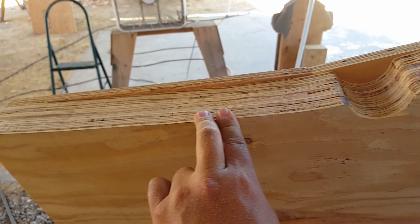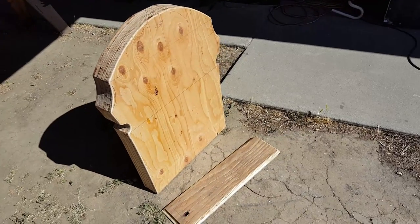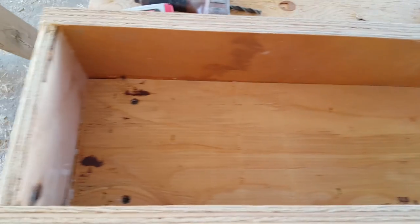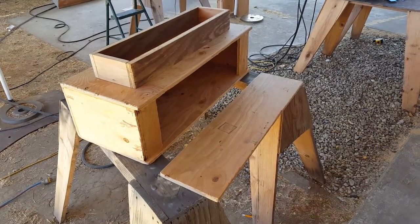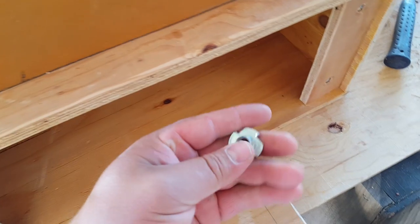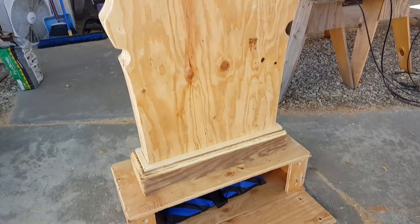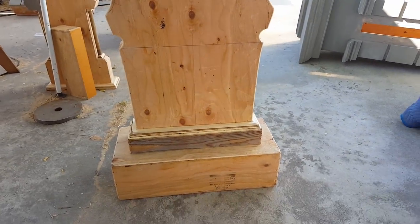Once the sides were done, I stapled and glued it really well. I used the flush trim bit with the bearing on the bottom or the pattern bit with the bearing on the top. For the bases, I wanted to make them heavy so it was hard for people to lift or move them. I created a little space inside, made a removable door on the back, drilled some holes for three-eighths hardware, and stuck some T-nuts in the back. For our own haunt we use bags of play sand, but for this project we ordered professional photography sandbags — fancy sandbags.